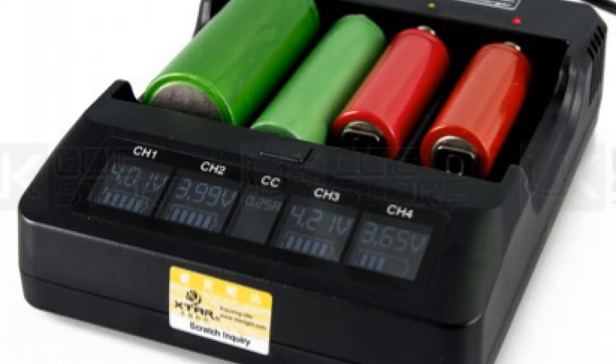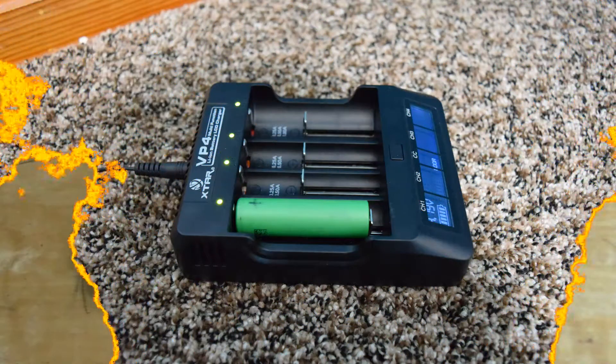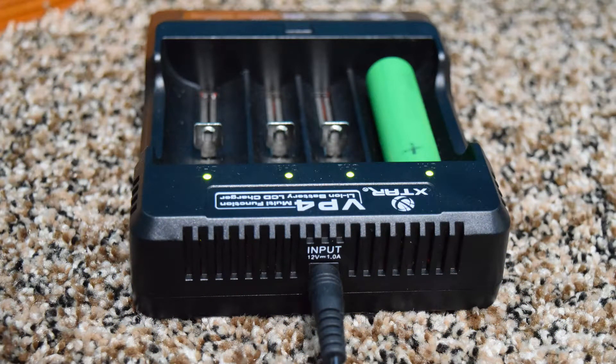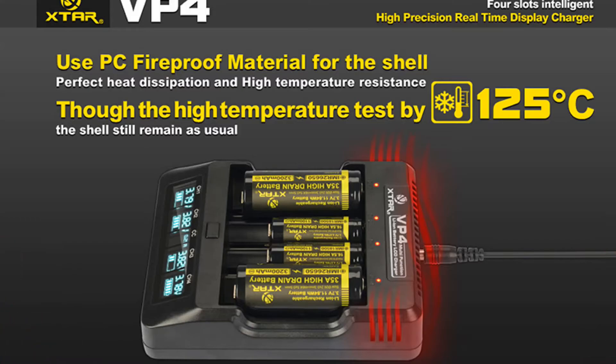It's got a soft starting function, so when you first hook the battery up it doesn't just throw one amp of current at it as soon as the battery contacts make contact with the charger contacts. You don't want a huge in-rush of current when you first make that connection. When the battery reaches full charge, the charger automatically cuts itself off. As you can see in the picture, the green light is on — it's saying it's charged and it's sitting at 4.2 volts at full charge. If you were to measure the current right now, it should be zero. We'll find out if that's true.